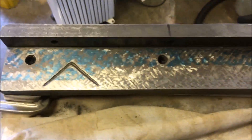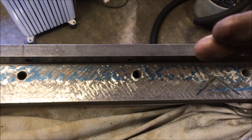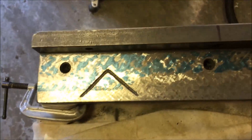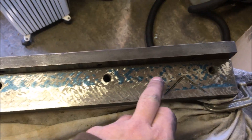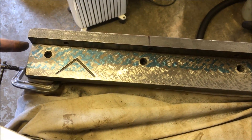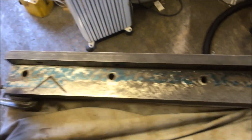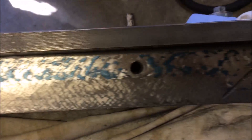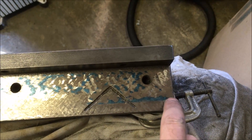This is what we're getting now — been at it an hour and a half, scraping down the far side where the gib sits. I'm trying to drop that down without tilting it so I get a 90 here. The way I'm printing is sticking the straight edge along this edge here, bringing it down so the end of the straight edge finishes here, with a two to three inch overhang this end, and moving it a quarter of an inch. My thinking is less movement will result in less tip.